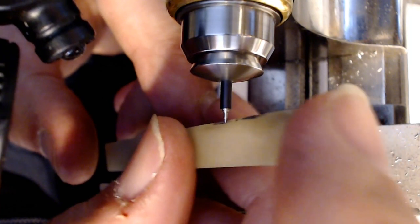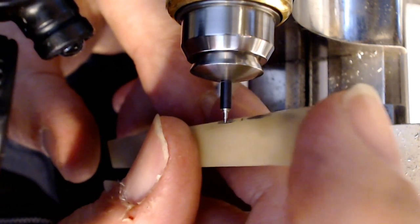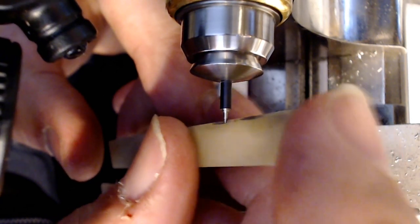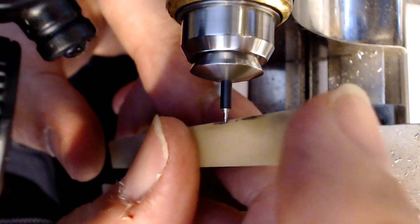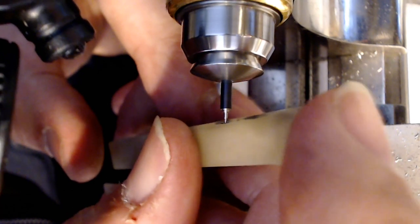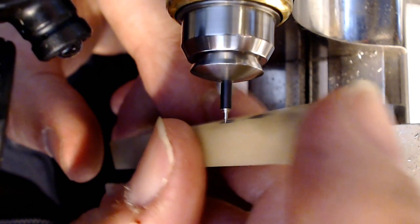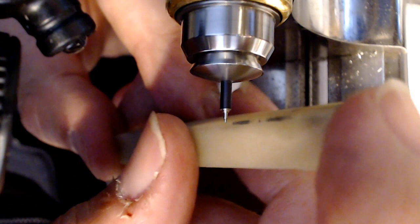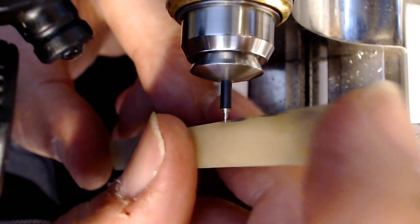I haven't measured the pivot yet, but it's probably about a 0.12 or 0.11 size pivot. Probably 0.11, because it's from a Hamilton 16, 17 jewel Hamilton, size 16. So I'm sure the pivot's probably a 0.11. So you see how this works? It's taking it down nicely right now. As you can see, the size is much improved.